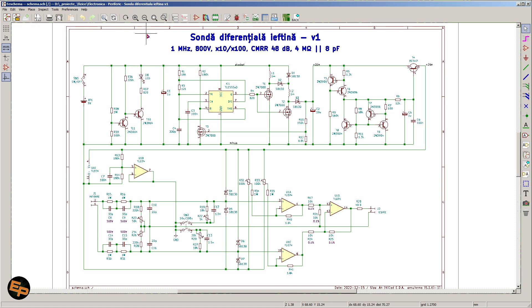Sure, it's not that much. Typical differential probes go up to 25 megahertz, but for us amateurs, in the vast majority of cases we don't need more than 1 megahertz. So this differential probe allows us to see signals up to 1 megahertz, even up to 3 megahertz if we don't care that much about precise measurements. I will show you print screens from the various tests that I've done — you will see what I'm talking about. It has two attenuation ratios: times 10 or times 100.